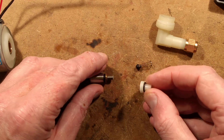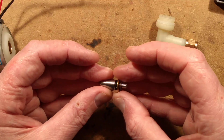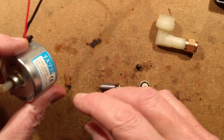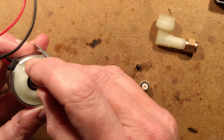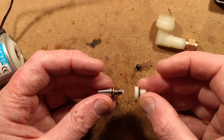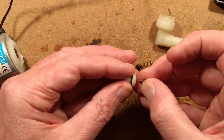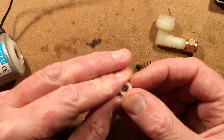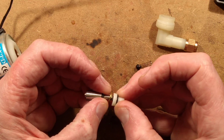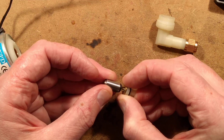Reassembling: once you've cleaned it — sometimes it'll be full of gunk and dirt — separate the components and make a note of what they are, because you can mix them up. There are about four o-rings in this, plus the spring and a sealing washer. Give it a washout and check the piston. When you put the o-ring back into the end of the cylinder and press it in, keep in mind that the metal plate will push against it and spread it slightly. Feel the pressure as it pushes in — there shouldn't be much. It should go in very easily without gripping too tightly.